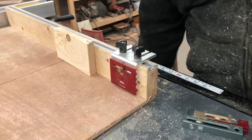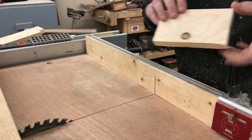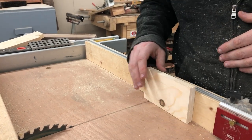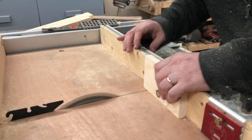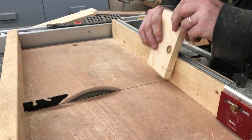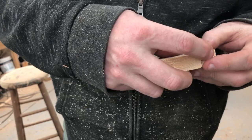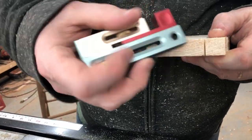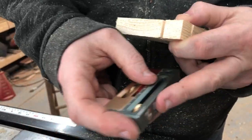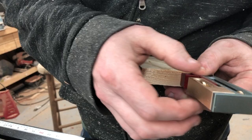The first thing you want to do is take a scrap block of wood — doesn't matter what size, as long as it's a square piece and not cut at a funky angle, just square. We're going to knock the corner off of this thing. If you set it back in there like it would be before you cut it, you notice there's an offset. The way it works: you take the largest piece, put it against that, then set the red piece — which is your offset for your kerf — and lock that down.